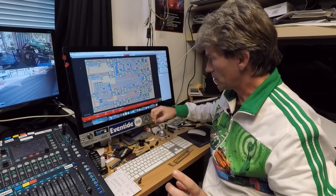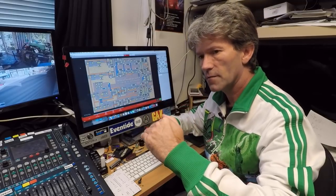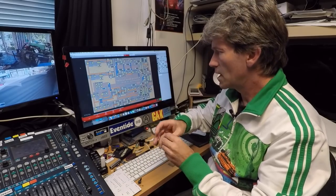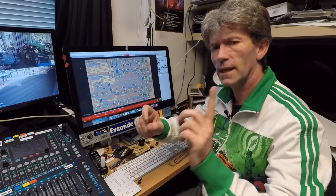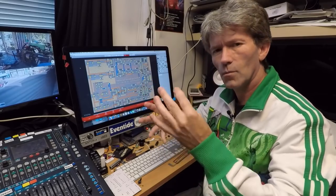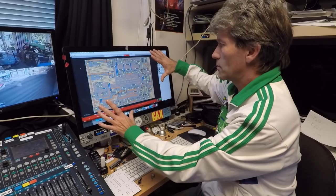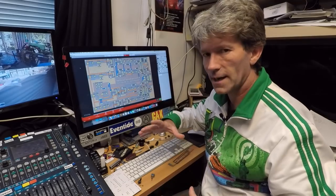I also figured out as I was going along, if you use the different circuit, if you have a sine wave in difference A and a triangle in difference B, and you flip them over, you get a different signal to them being unflipped. So I'm going to add this little switch on there as well, so that it swaps the input A and the input B over. And yeah, it kind of gives a different waveform. I've been playing about on the oscilloscope and I don't know why that works, but it does. So anyhow, there we go. I'm going to get this etched, put the components on the board, and then find out where all my mistakes are.